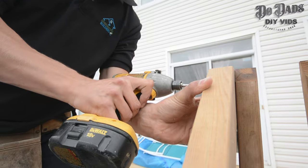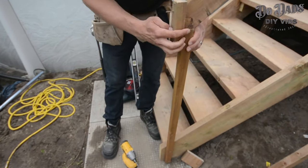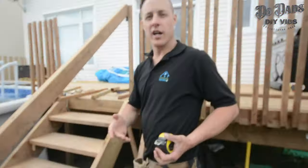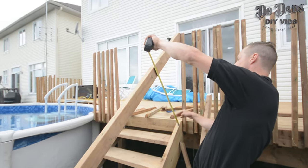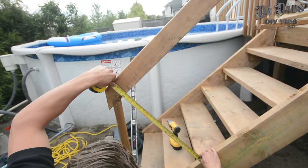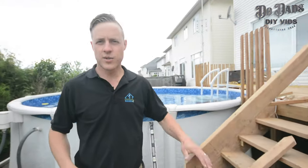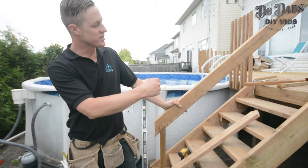Because I went an inch and a quarter at the bottom, I used another spacer — just bump it until you're perfectly at an inch and a quarter, then put your screw in. A good way of checking that your top rail is done properly: take your tape and run it on an angle so it's coming at a right angle to your top rail. I'm at 24 and a quarter on one end and 24 on the other, so this end has to come up a quarter of an inch. I like to have all my spindles shooting from the top down. So I'll start from the stairs and work it down.